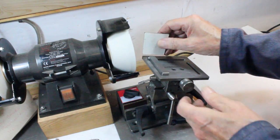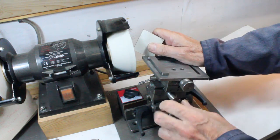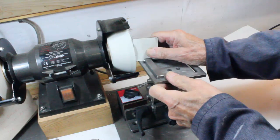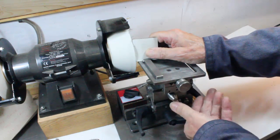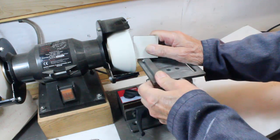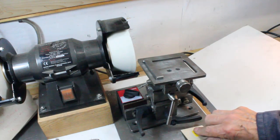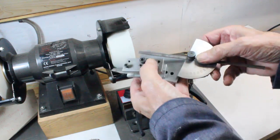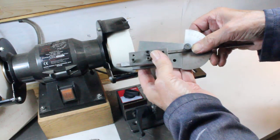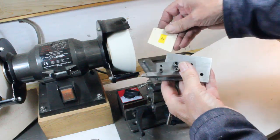We now see the first angle being set up by tilting the table. For the second angle, the swivel plate is used and set up using an engineer's protractor or a simple card as used for the first angle.